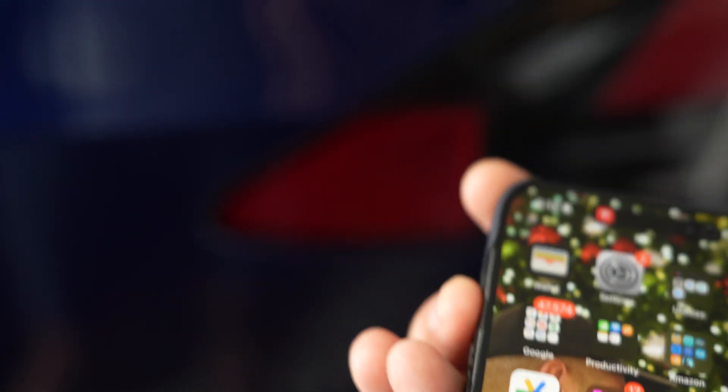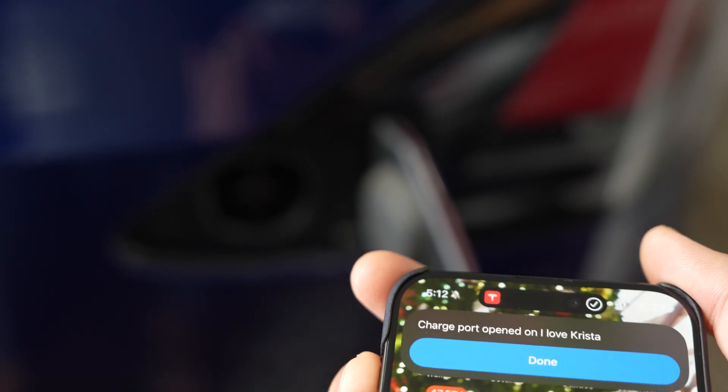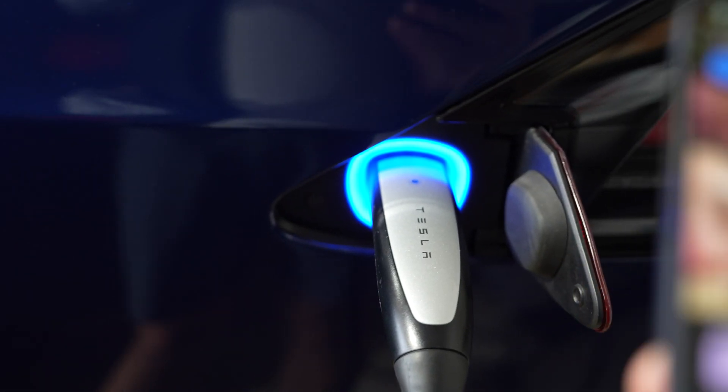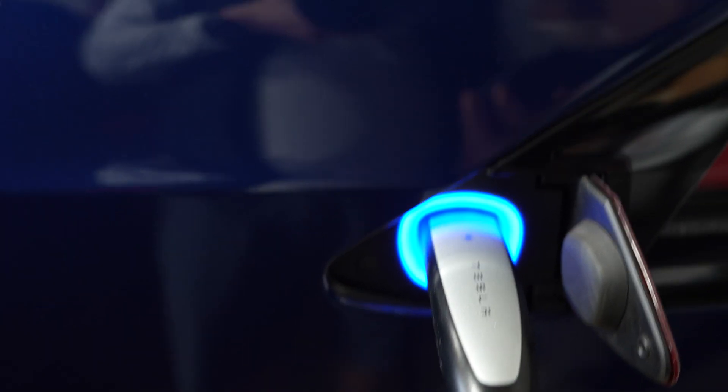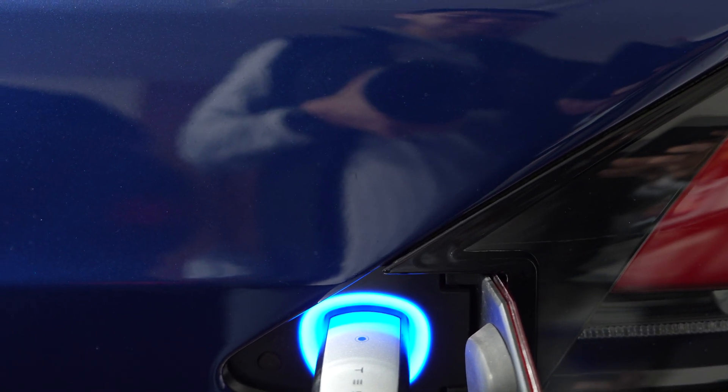For the Delta Pros, you don't want both inverters working so close to maximum output all the time, so you can adjust the amperage on the Tesla app to lower the load a little. This way of charging is both flexible and fast. If you're going to do this with solar, it's always better to charge when the solar is charging so power goes directly from the inverter into the Tesla rather than into the battery first and then into the Tesla, as there is some line loss each time power is traveling. You can try to match the Tesla charging speed with the incoming solar.